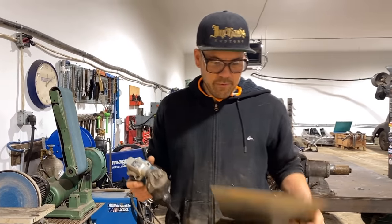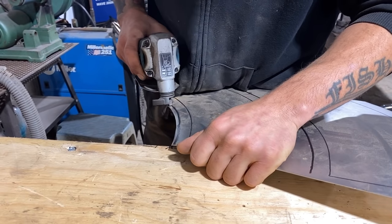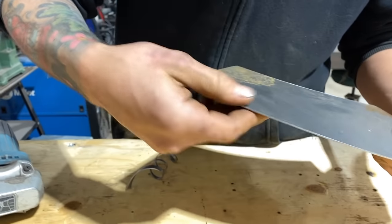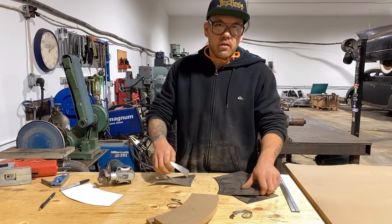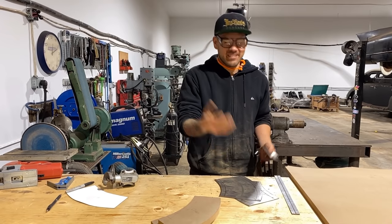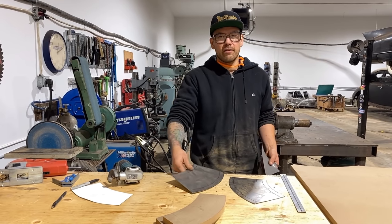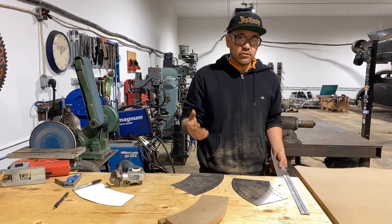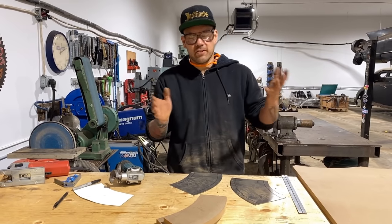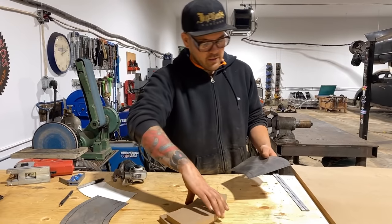If you're looking for something, this is the first thing I'd get before buying a stomp shear. There's also barely any burr on that metal. Something I always forget to mention that everybody asks every video — what material thickness am I using? This is 18 gauge sheet metal. I use 16 gauge for structure like floor braces, but for exterior sheet metal or non-structural stuff, 18 gauge is great. Most vintage American cars are actually 19 gauge for body stampings, but that's harder to come by, so 18 gauge works great.